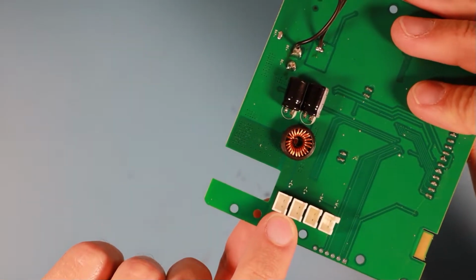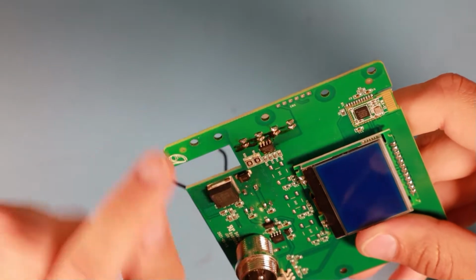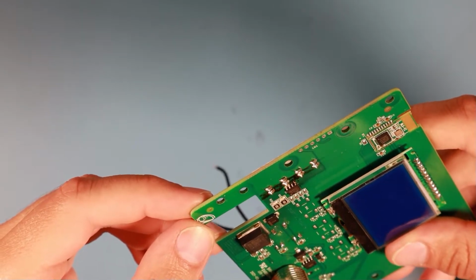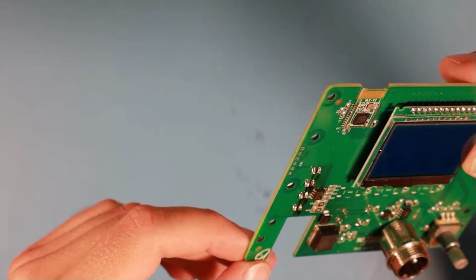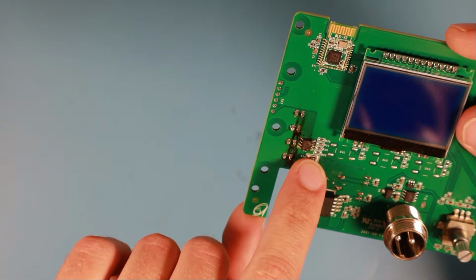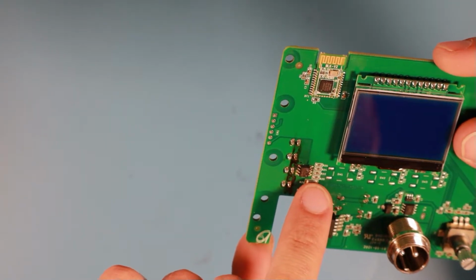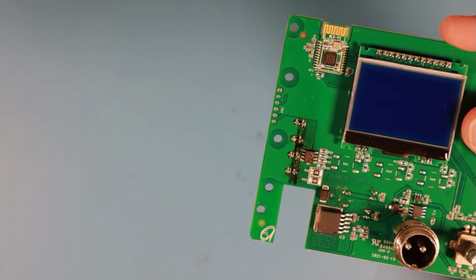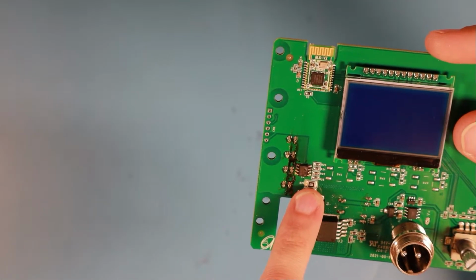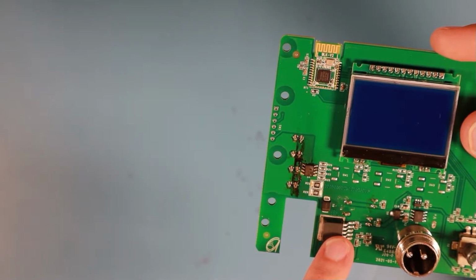The only thing I can see is that the left two and the right two connectors for the LEDs are separated. So they are switched between by this IC. So I think I should, okay, maybe this is a kind of a MOSFET. I think I should get a data sheet for this. But it seems that on the right side the upper 2 or 3 pins are connected to digital signals, and the lowest pin on the right side, or pin 1 I think from the markings, is connected to these 2 resistors and then gets fed by the LED driver.